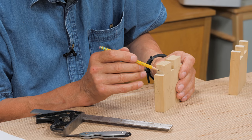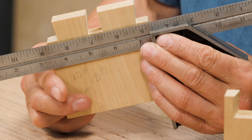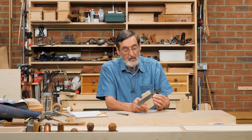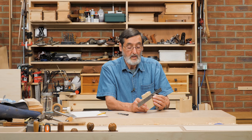One more thing — the shoulder line on this is rising. This point is much higher than this point here. When I bring the square across you have lines there that you should have worked to, and if you had used a knife wall I think you would have seen that the knife wall would leave a slight rim that you could work to with a pair-cut, giving you the perfect line. So please keep at it, keep practicing, make a few more dovetails, then make your box — and in a very short time you'll be making dovetails just as well as any pro.